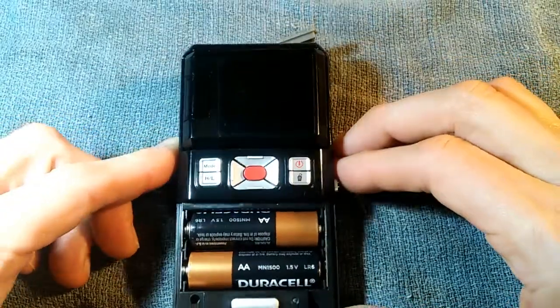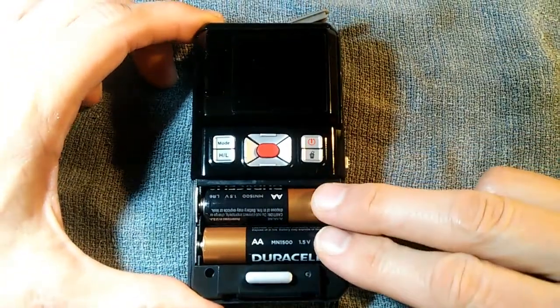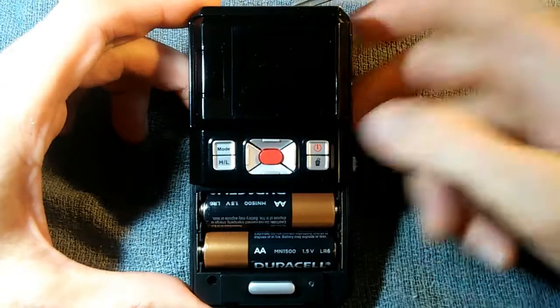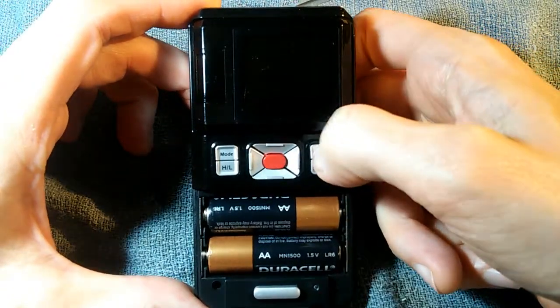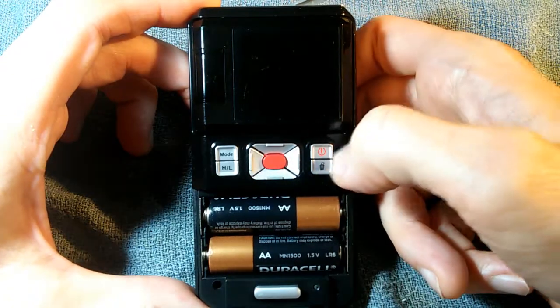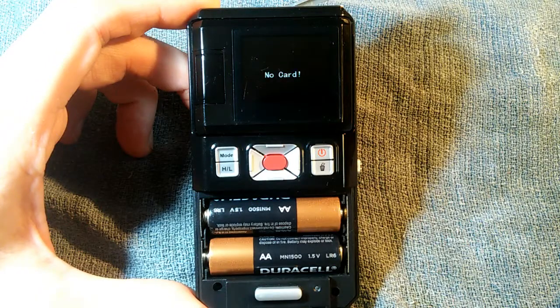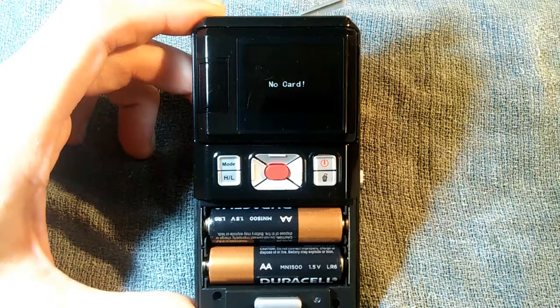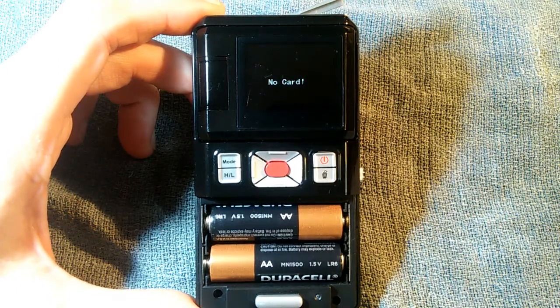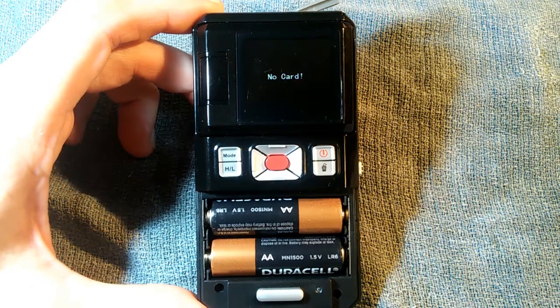I'm going to have it all put back together again and ready to test it out. I put in a couple of AA batteries. Now the one thing about this on-off switch — you can't just momentarily hit it like that. You actually have to hold it for like a second. Okay, it is working. Excellent. So presumably there was some oxidation on those pins which was preventing the thing from working. That was a nice easy and lucky fix.